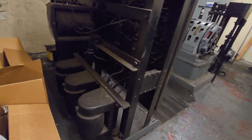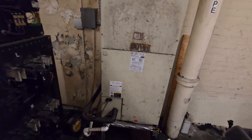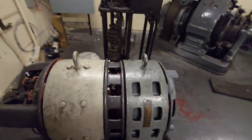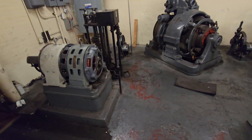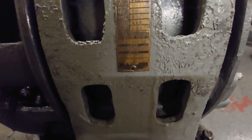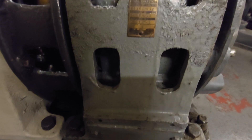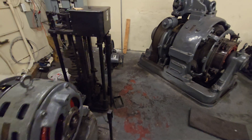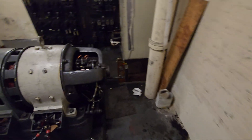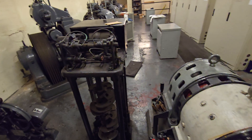The reason I keep going behind is I'm stopping randomly because I'm getting a bunch of pictures. It's nice and cool in here — it's not burning up. The only thing really producing heat right now is this DC genset, and I'm kind of surprised it doesn't have an auto shutoff — it's definitely using up some electricity. It takes 25 horsepower, 1200 RPM, 220 volts, 65 amps. It's definitely going to drive up your electric bill with this thing running nonstop. But it's better than it kicking on and off all the time — apparently that's what originally caused it to have issues and need a rebuild.